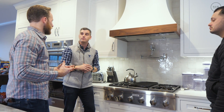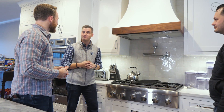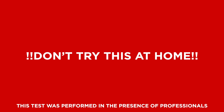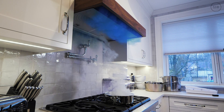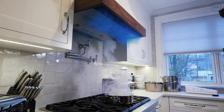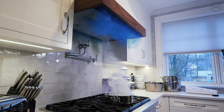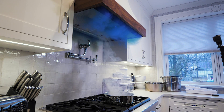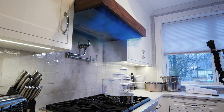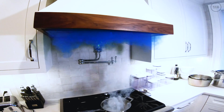There's a lot of back and forth whether or not this works — so we're doing smoke grenade testing. We lit smoke grenades in a pan, put them on the back burner and the front burner, and watched the exhaust hood work. Then we added blue smoke from the intake air from outside to show if the intake air was actually going to work correctly. We were looking for spillage — whether the white smoke would not be captured and be pushed to the side. We tested the fan at high speed, but we could have also done tests at low or medium speed.